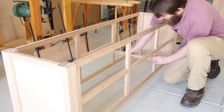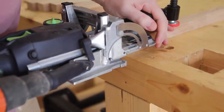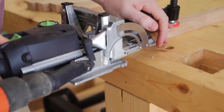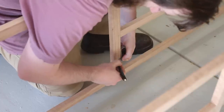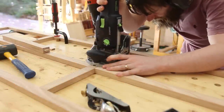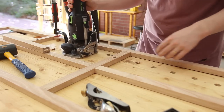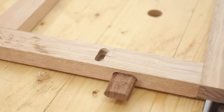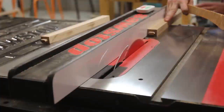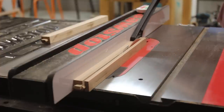This top area isn't having a drawer, but both drawer slides will sit into the one below it. I'd forgotten about these stretchers until after the glue-up so I had to add them in a similar way to the corrected leg mortises. The two central rails were going to be too wide to accept the veneered MDF for the set top box cavity, so after gluing in the tenons I ripped them to a better width.